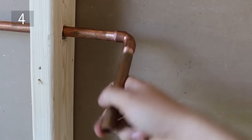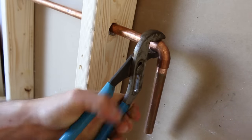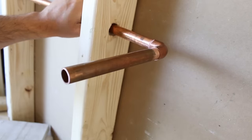Number 4 is running into an unsupported pipe that needs soldering. A quick way to make it hold in place is to grab a pair of pliers and lightly crimp the fitting. This will allow you to place it straight without having to install a support.